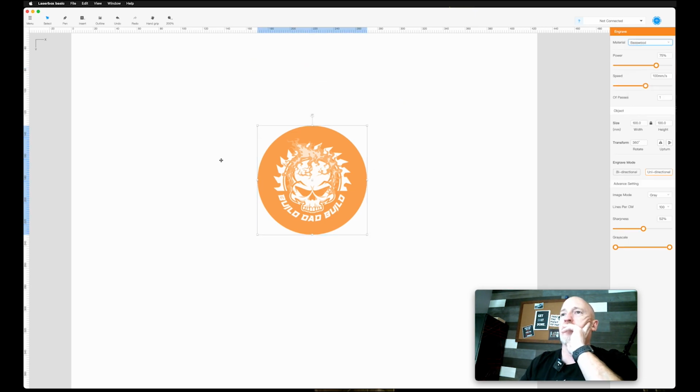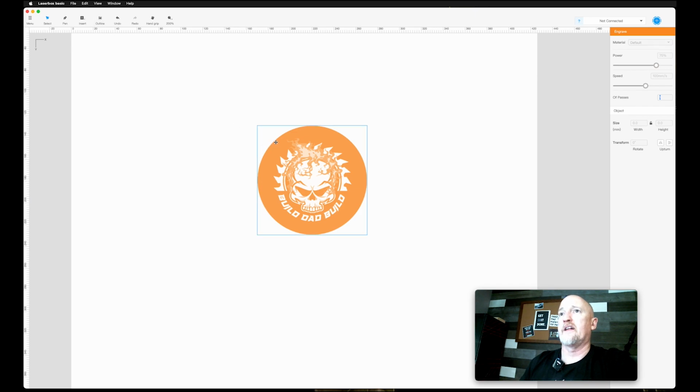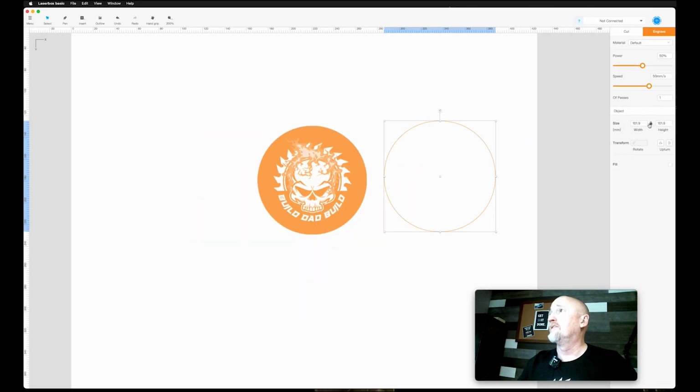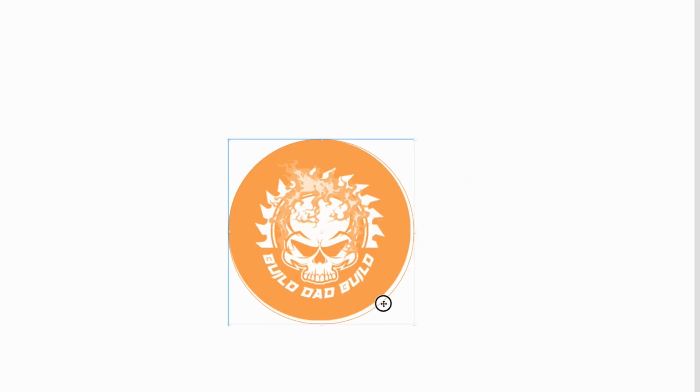Let's just go through how we would do this. So here's my logo. I want to engrave this, and then I want to cut it out. So I'm going to select outline. After that, it's going to give me an outline. Now, just because I want to, I'm going to make this outline a little bit bigger. The biggest issue I have is sometimes you'll get something stuck on something else, and you can't edit the first one. So okay, let's come in here. I'm going to lock that, and I'm just going to go 120. I'm gonna make that just a little bigger, and then I'm gonna come over here. You'll see it lock in a second.